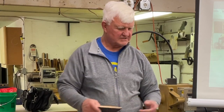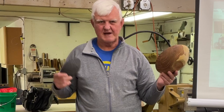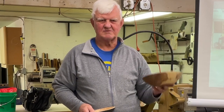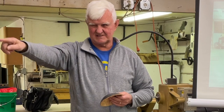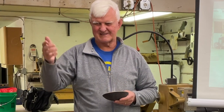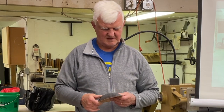I thought it was burned this afternoon — actually a little more story here. This bowl this morning was sopping wet. I turned it yesterday; it's some of Mike's elm and it was not light — it was soaking wet. How did I dry all three of these bowls this morning? I have a microwave — I talked my wife into a nice new stainless steel one and I got the old one. You've got to get a rotating table. If it does not rotate, you'll burn a hole right through the grain and it'll start smoking. I only do it outside — I won't use my microwave in the house because I don't want any extra flames.